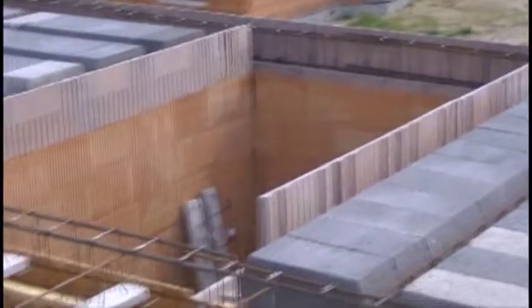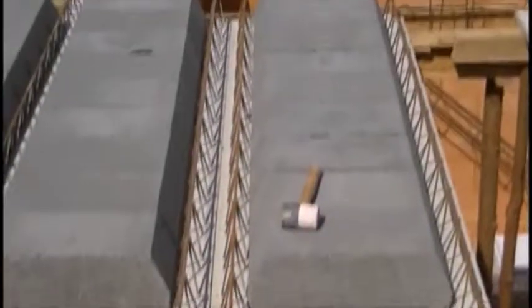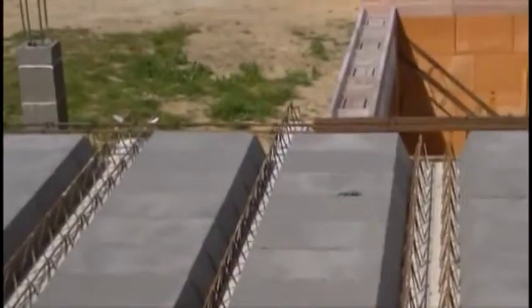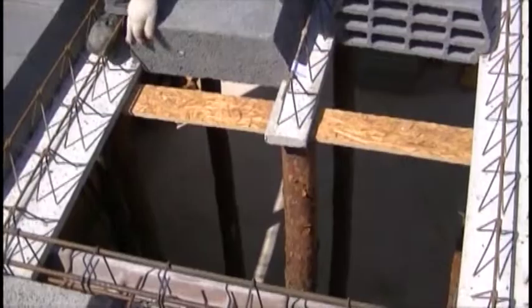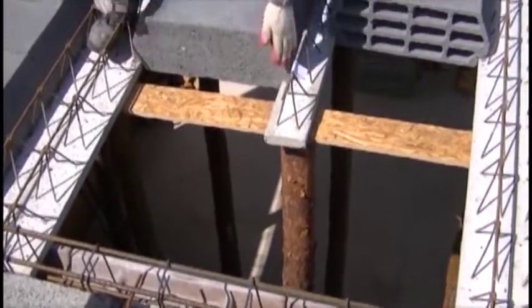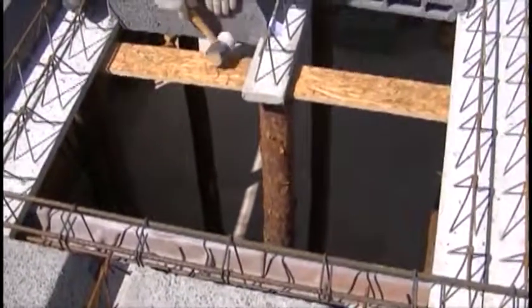The hole that every now and then is visible through the film is of course the place where a staircase will be. Now you see the place where the ceiling passes the chimney. As you can see, from both sides we put double beams while the middle one is shortened. At this point add reinforcement that will be supported on these double beams. In this way we will build the so-called exchanges, which will be responsible for supporting the central short beam.